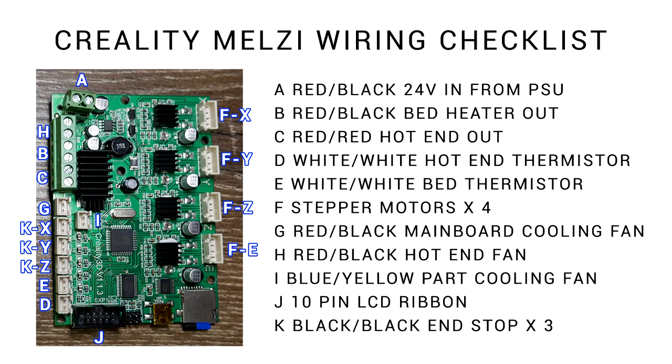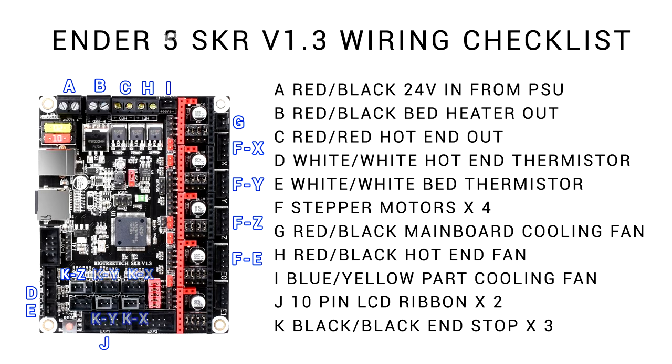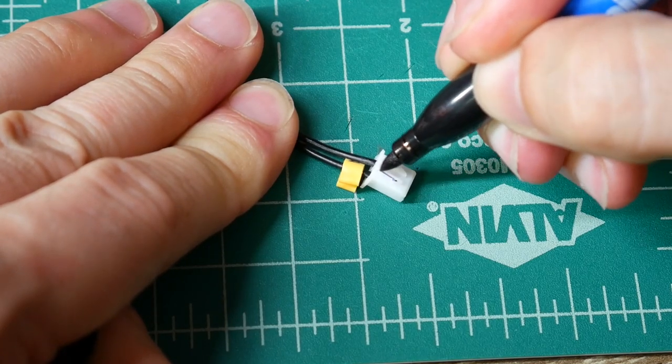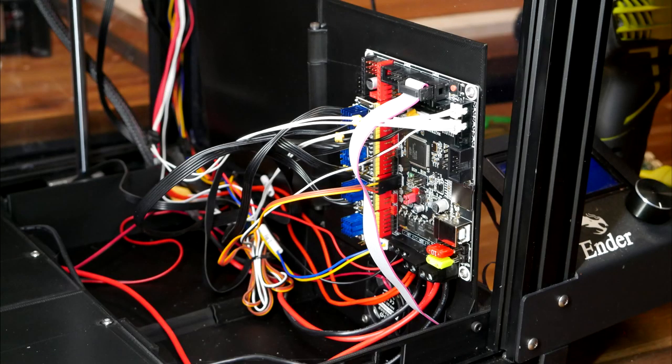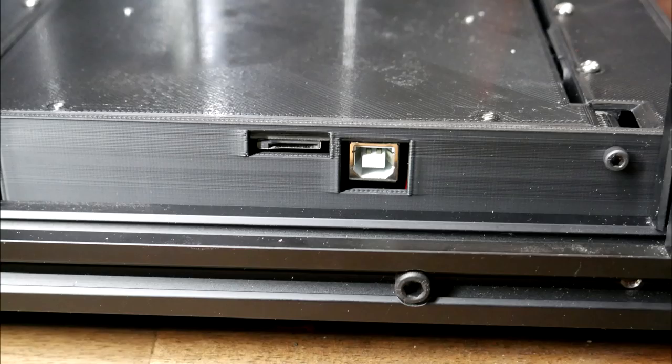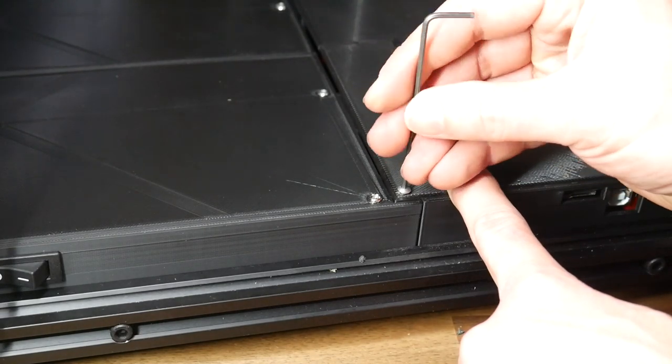Both of these mainboard upgrades have the same mounting footprint, so reuse the factory M3 bolts to hold the mainboard onto the underside of the lid. I've made a diagram to help you when you unplug the wiring from the factory mainboard. If you're wiring up an MKS Gen L, the wiring is almost exactly the same as an Ender 3, but because the Ender 5 homes in a different direction, you need to plug X and Y endstops into X and Y max instead of X and Y min. For the SKR, it's exactly the same change — the X and Y endstops plug into max as well. These diagrams are linked in the description, and I'd recommend making a hard copy to keep near your printer. The wiring is plug and play apart from the endstops. Mark the left-hand lug as seen here, and then use a knife to carefully slice it off — they're now ready to go. Plug them in as per the previous diagram. With everything in place, you should now be able to close the case and double-check that everything lines up. Around now was the time I decided a small securing bolt was needed, and you'll find this in the STL of the final version released on Thingiverse.